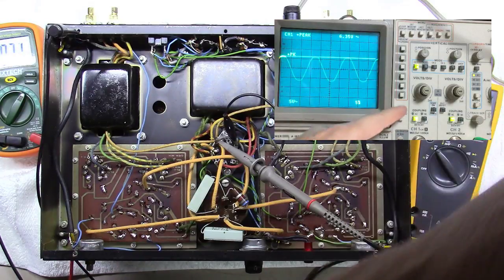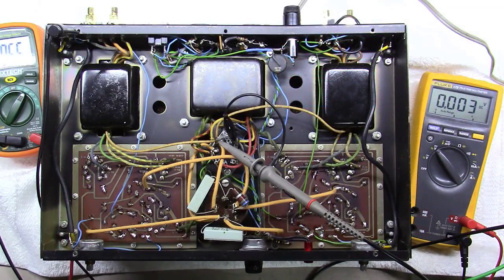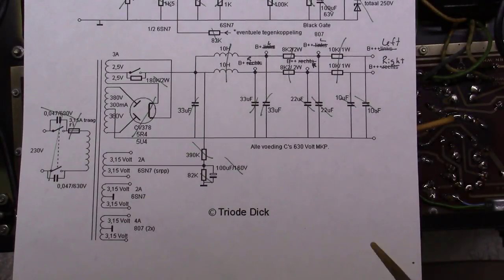I can't show you the DC on this little scope because it's more voltage than it can display, but I think you get the picture. Both AC and DC can exist at the same time at the same location in a circuit — the DC offsets the AC. There are also times in tube amp schematics where you specifically want to float your AC on a DC offset. Here's a good example: this single-ended amplifier build I'm working on — I'm still waiting on the chassis to come back from the powder coat shop.